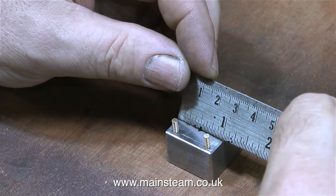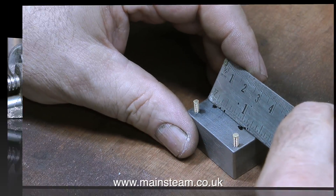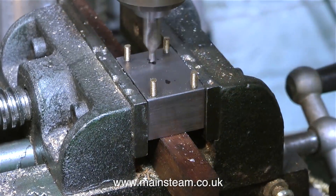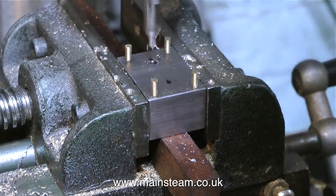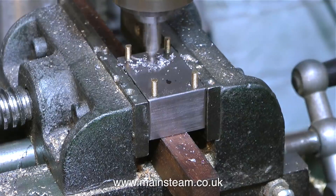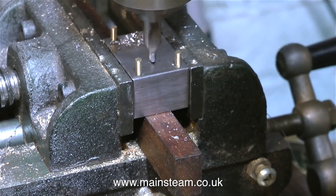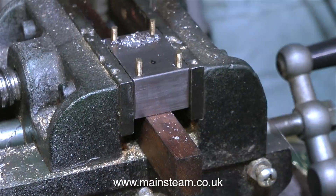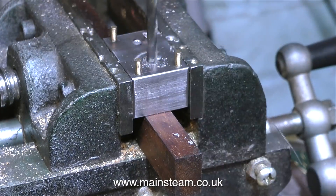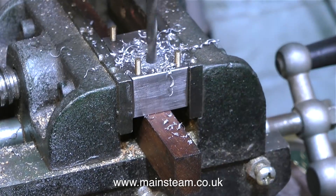Here's the pump sat on its block. But not just yet — I need to drill a couple more holes because the block itself will need to be screwed down to the baseboard. I'm checking the dimensions with my steel ruler before I commit myself and drill the holes all the way through. As usual, I pilot the holes using a centre drill, making doubly sure that each hole is in the correct position. Once I'd centre drilled the first hole, I wound the cross vice into position to drill the second hole. After the centre drilling was completed, I drilled the holes all the way through with a 3/16-inch diameter drill.